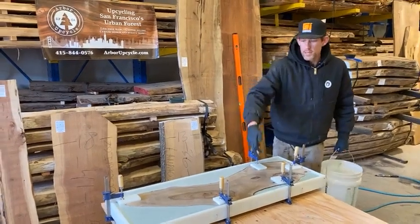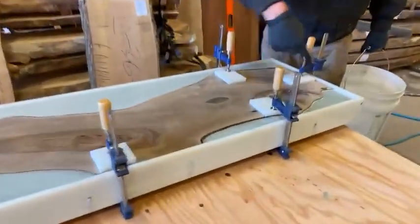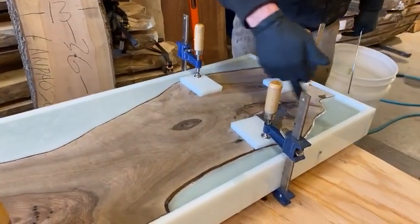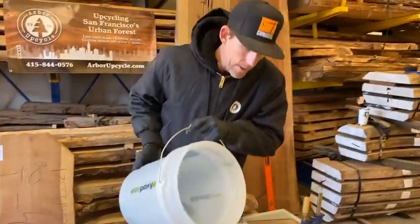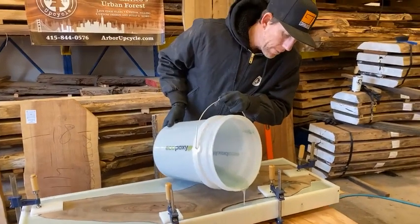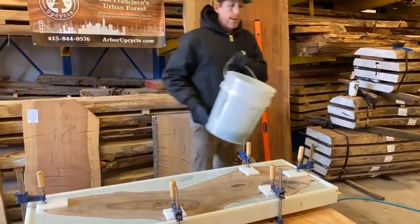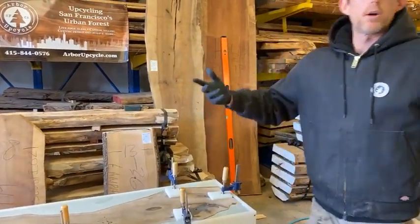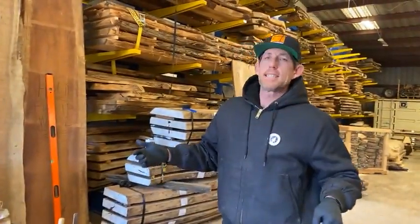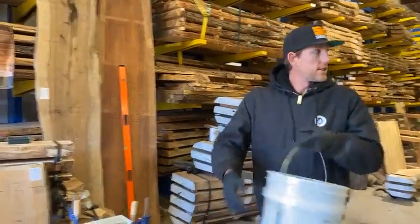Then I did this one, so I did 3 points: 1, 2, 3. I figure out what this is, which is like 3 by 18. We're not building a piano here, so we might have a little tiny bit left over in the end. It's not going to be down to the drop. What I do is average my width over the length, and then I get a pretty good educated guess. Then I add them all together, and it gave me like 9.87 liters. So I said 10, because we have a ton of other pieces here that I can dump this little tiny excess into.